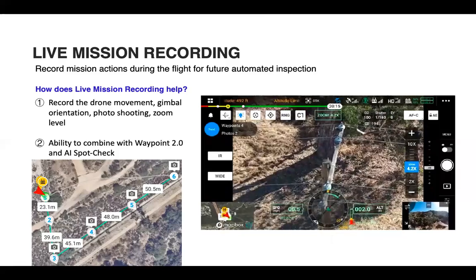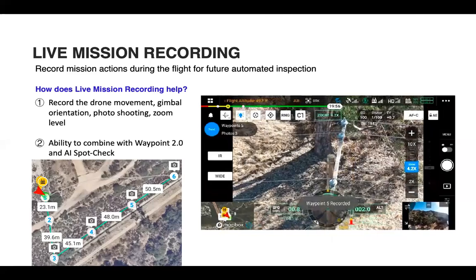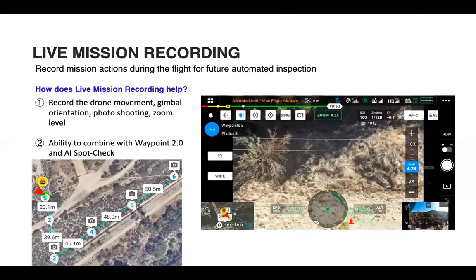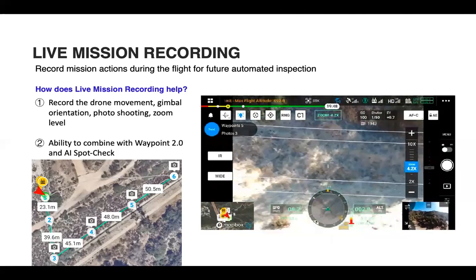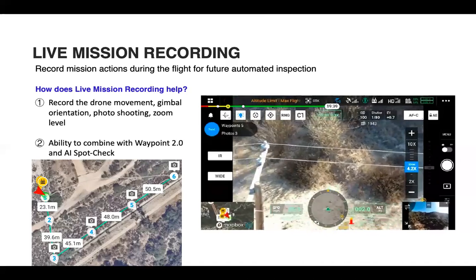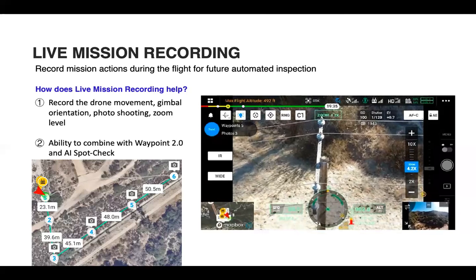If you approach some shadows, you can do a single tap and adjust brightness up or down. During the mission, autofocus will be continuous, so you don't need to manually focus the camera at each specific point — that'll happen automatically as the drone stops at each waypoint. As you continue along the distribution line, waypoints are recorded each time you take a photo.